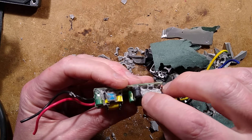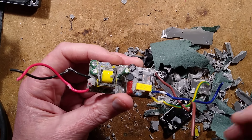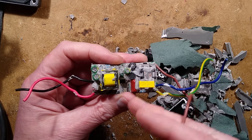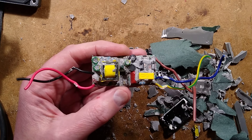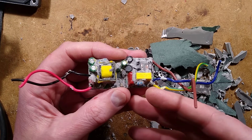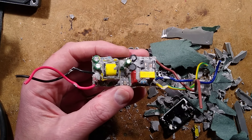On the output we've got a couple of capacitors, a high-speed diode, and another little toroidal common-mode suppression choke on the DC output. There are also a couple of inductors whose exact position in the circuit I'll check against the data sheet. This thing is made to a very high standard. The suppression on this is really good quality. We'll take a look at the manufacturer's recommended schematic now.